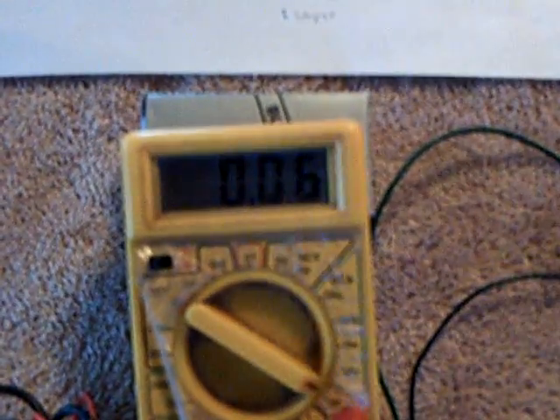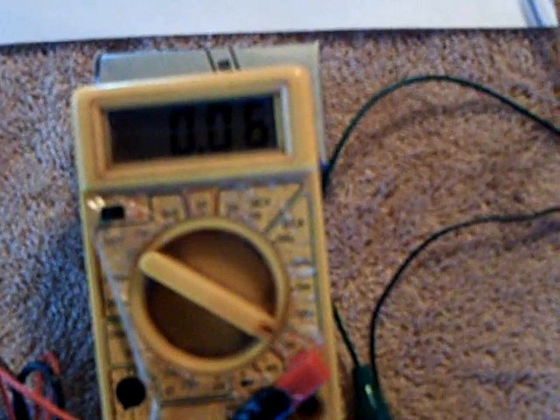That's about 60 milliamps. I can get this to stay on at about 40 to 50 milliamps — there's 40 milliamps and it's still on. There's my voltage on the cap now. That has to be quite a bit higher than your source battery, otherwise you're not going to charge it. So that's what I wanted to show.